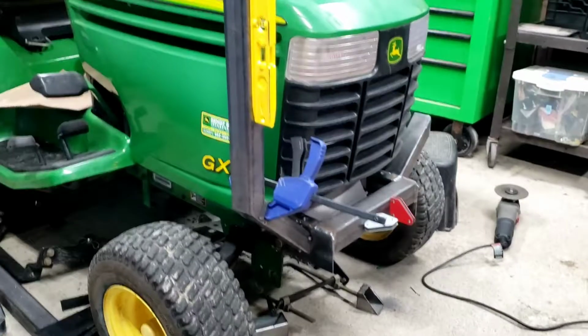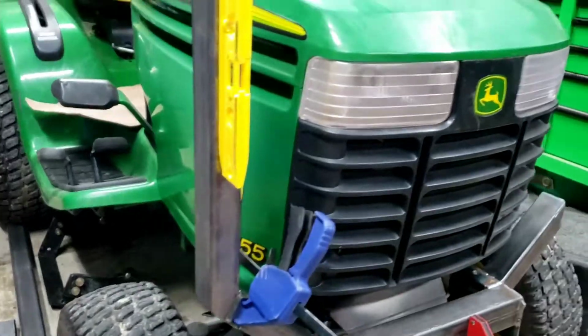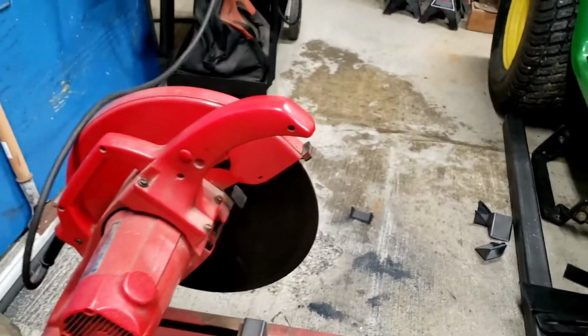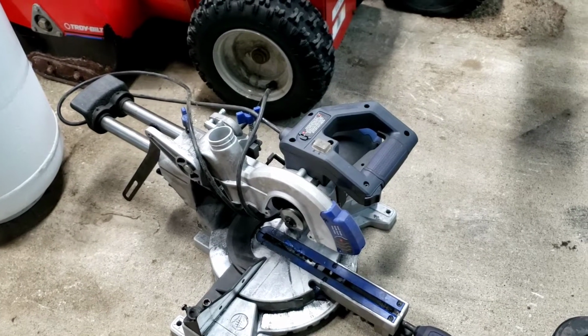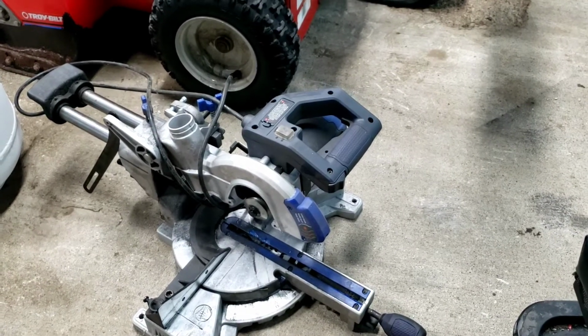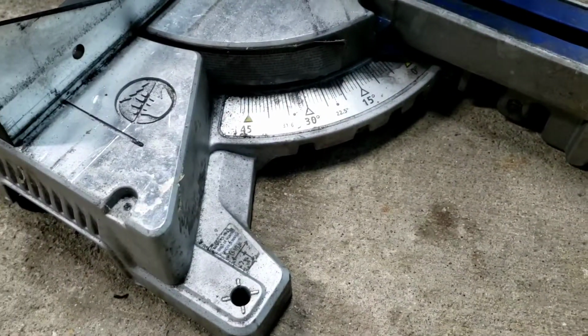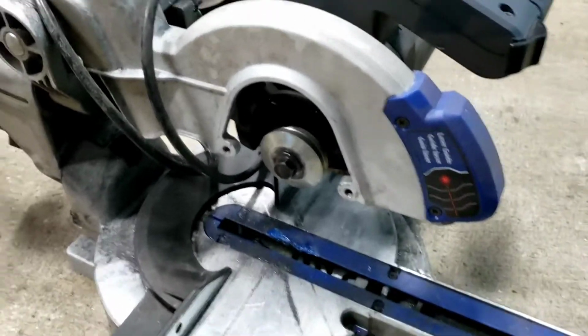This thing seems to be turning out okay so far. I took a little bit of a break for lunch, but I came back down and cut that vertical piece with this chop saw, and believe it or not, that is more accurate, more powerful than a small little chop saw for wood. That's a Cobalt brand, and I had bought a Diablo blade, a metal cutting blade to toss on it. Figured it'd be a lot easier, with the quick adjustment and everything, and set my angles, because I knew I'd be going back and forth from straight to 45, straight to 45.